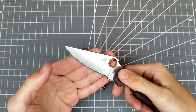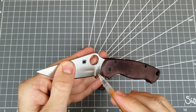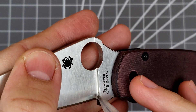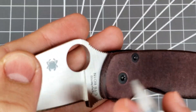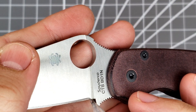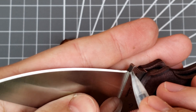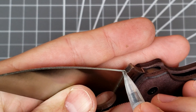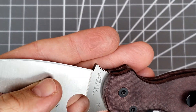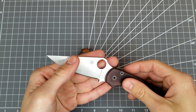Here's an example of a knife that has a 90-degree plunge grind and no choil. Spyderco does this really often — their plunge grind will go straight down at a 90-degree angle from the full thickness down to the final thickness in a straight line, so there's no sloping gradual plunge grind. They can get away with not having a choil; you just need a stone with a sharp corner to get all the way back in there. A sharpening choil does make working on these edges easier and definitely makes them a lot easier to sharpen. It's a personal preference, but I've added a lot of choils on Spydercos and it definitely makes it a lot easier.